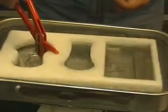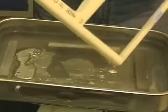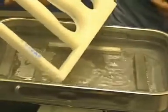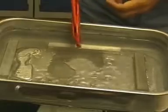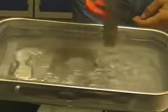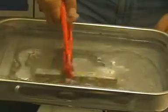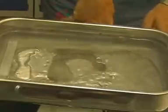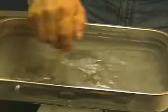The original raw material is removed from the water. All blocks used to prevent the piece from having direct contact with the bottom of the water bath are removed. The remains of the LM70 alloy are brushed into a corner of the bath to solidify into one lump for further use.